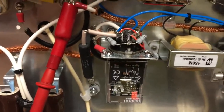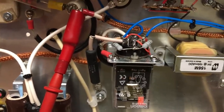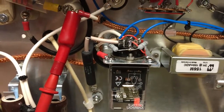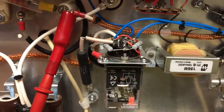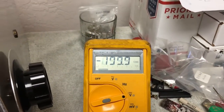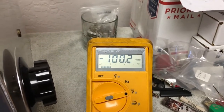When the relay is not engaged, that'll be on the resistor, and it'll drop down to like minus 200 volts with the grid drive applied. Then when I click this and engage the relay, it'll have a fixed supply. I don't know where it's supposed to be yet — it's supposed to be anywhere from like minus 75 to minus 150, could be anywhere in between there.